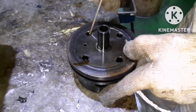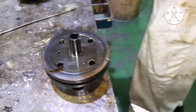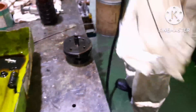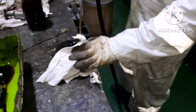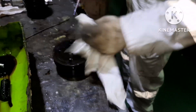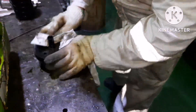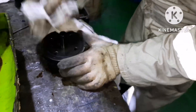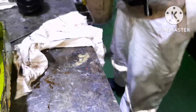Remove all the dirt from the suction valve and blow air. You can see I'm blowing air on all the slots so that you ensure the suction valve is completely clean. The piston groove and piston guide area should be properly checked for any kind of damages. I had cleaned the suction valve body completely, inspected the valve seat area, cleaned with diesel, and blown air.